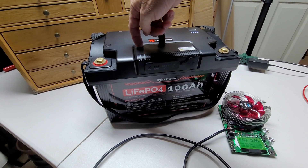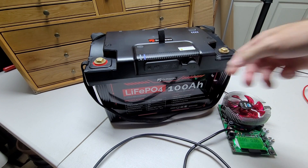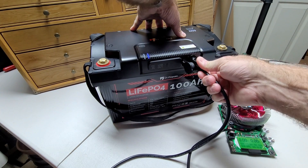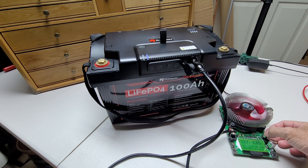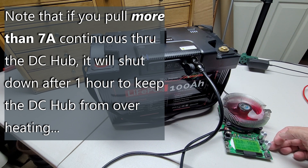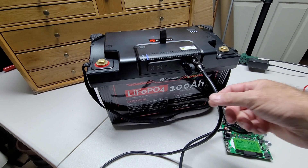The battery is fully charged, so we have to turn this on. We're reading 13.6 volts down here. We're going to dial this up to about 10 amps, which is typically what I use to discharge these. That little sticker on there said don't try to discharge past 12 amps, so 10 amps is where we are. And we'll see how much power we get through this hub from the DC port.